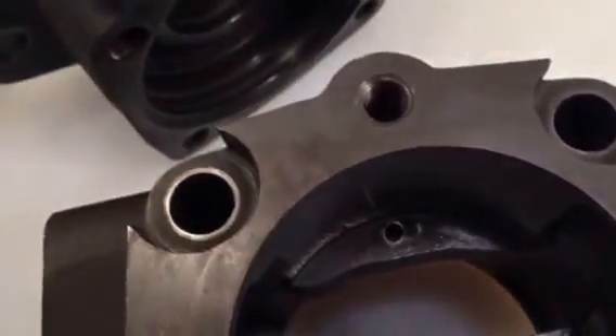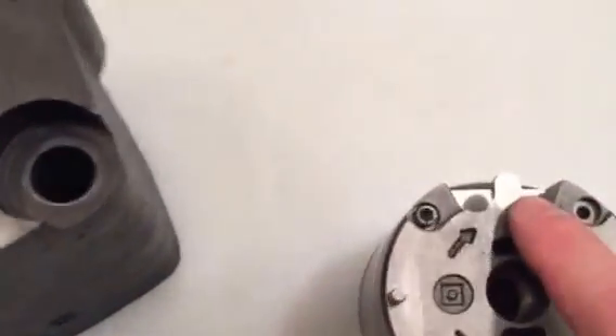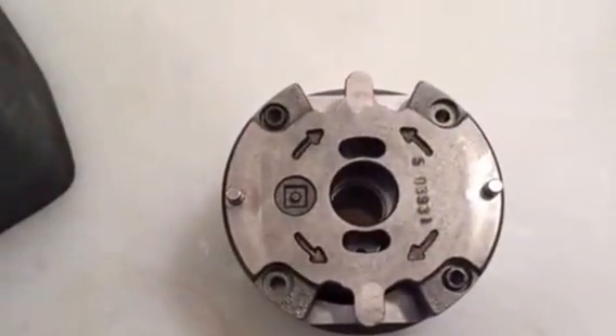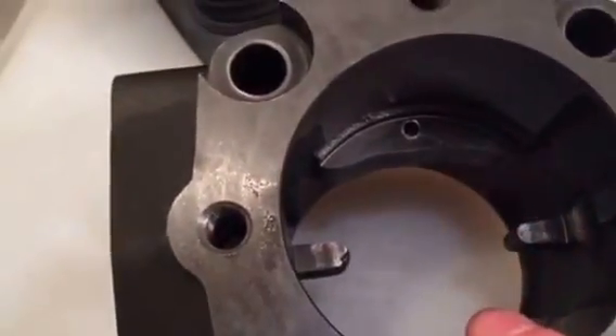When you look at that step that's machined down in here, that will also block off the oil into this area. So it's going to be very limited how much oil can get into this cartridge, and it can really cause some catastrophic failure. So again, it's important that these dowel pins line up with the dowel pin holes in the housing when assembling this pump.